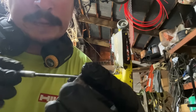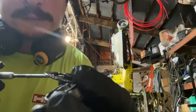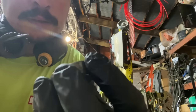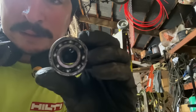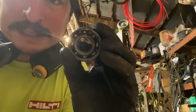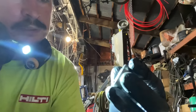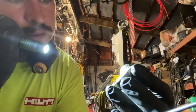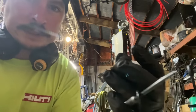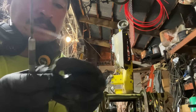Another thing I see a lot of people say is that you can't do anything with the bearings because they're sealed bearings. Well, there's not much to the rubber seal — it pops right off, you can do it without damaging the seal. The grease inside this bearing looks to be either the same kind of grease that was in that assembly, the bluish green stuff, or maybe black. It looks green. So we'll put these back in and grease the assembly. Let me pop this other one apart.